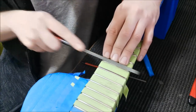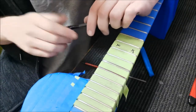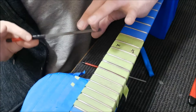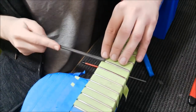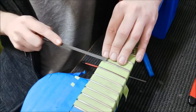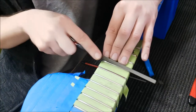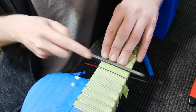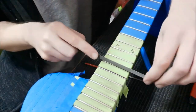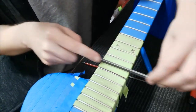When you do end up with better tools it does take time. You can go all out and buy fancy tools if you want — in Australia we don't have the luxury because postage is a killer. When you do end up with good quality tools the job is a lot faster. I prefer triangle files to pre-crown crowning files because I believe I can get more accuracy and there's less chatter, since most crowning files are one-way and people use them two ways. There are certain files you can buy that are two-way, but you really have to understand how your tools work and what their purpose is.